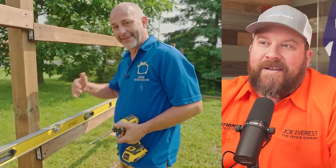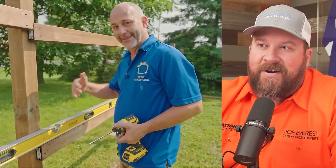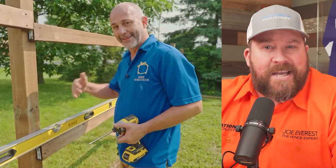That's a good stopping point with that quote. As a professional fence builder, I typically look at the horizontal line — so he's not wrong there. But a fence that stair-steps like this is a surefire sign, at least in our area, that it was built by a homeowner or a handyman-type contractor. Do yourself a favor — take a little bit of extra time. Make everything flow nicely together instead of trying to stair-step down like this. I think you'll be happier with the result.